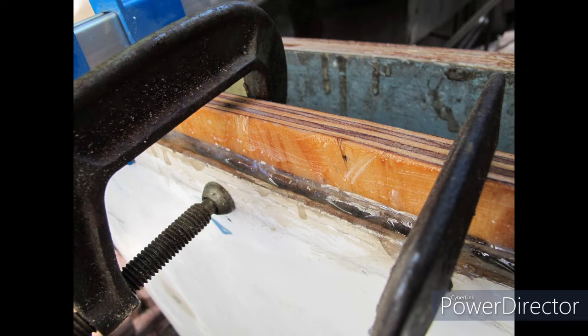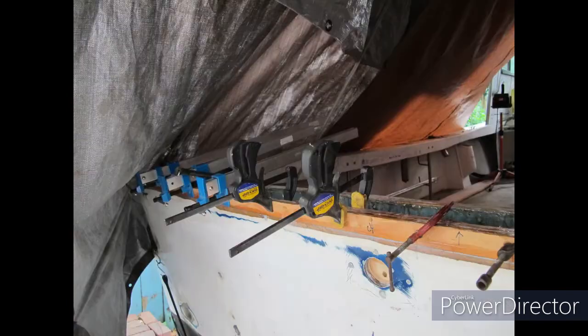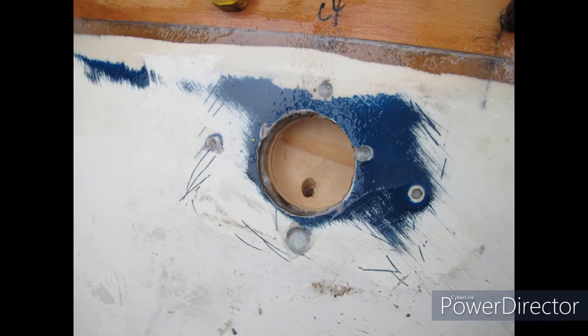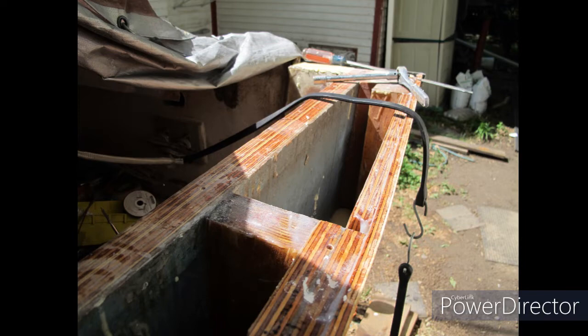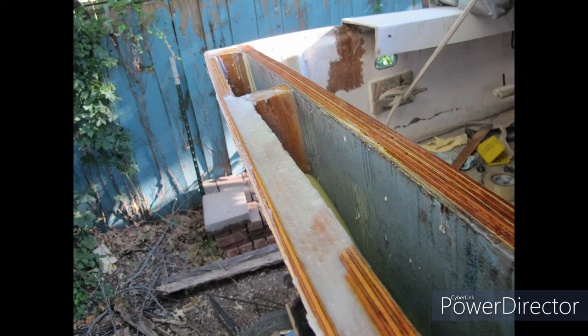This is the piece where I had to fill in the top of the transom where it didn't match up, because the way I built it is different from the way the original designer did — his way ended up getting rotted, so I replaced it. That makes it flush all the way up to the top, nice and smooth. There's where my stern light is going to go through — you can see the hole for the wire — and that all got sanded, smoothed, and faired. 18 ounces of fiberglass went on that outside lip.